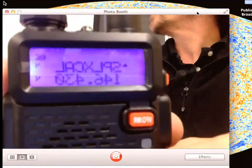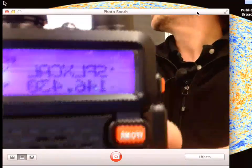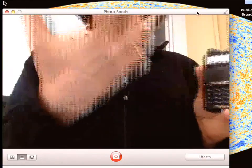Whenever the triangle is showing, that's where it's going to be transmitting. The upper display shows the name of the channel, while the bottom one always shows the frequency. If I programmed it and you want to know the frequency, just go to the bottom display, type the same channel number, and you'll see what frequency it's programmed to. That's why I set it up that way — it's helpful.